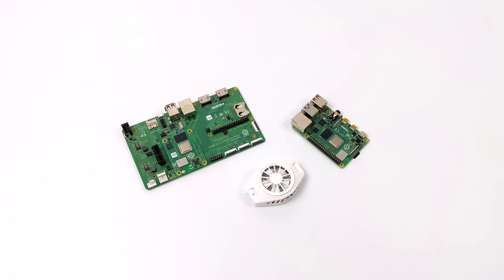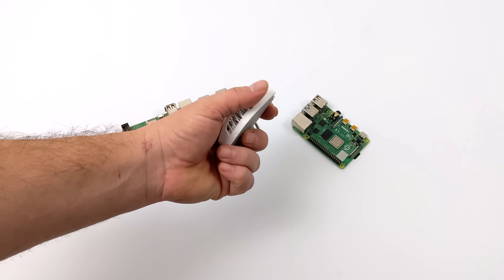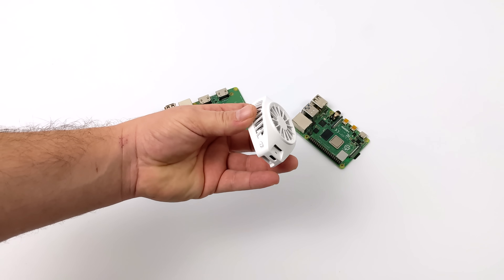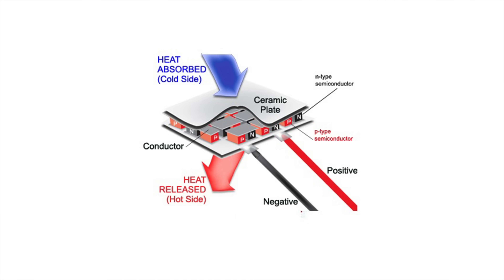If you're not familiar with these thermoelectric coolers, that's totally fine. I'm going to go over it real quick. This one here is actually a low-powered version — it pulls five watts. It's purpose-made to go on the back of a cell phone to keep it cool while you're gaming. Basically, the way it works is we have a hot side and a cold side, and right in the middle are the conductors. When electricity is introduced to the conductors, one side gets really hot because it's pulling the heat from the other side, and the other side — usually consisting of a ceramic plate — gets really cold and can actually produce ice. But this is a very inefficient way to keep things cold, which is why it isn't used in our refrigerators or freezers.